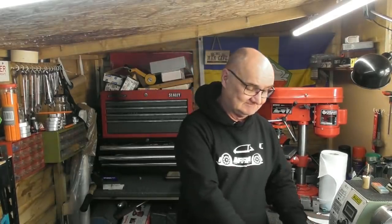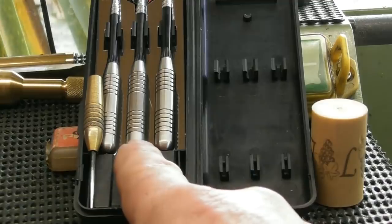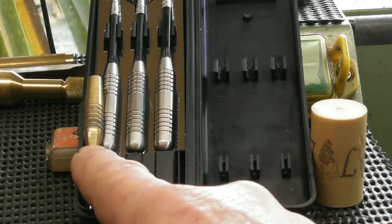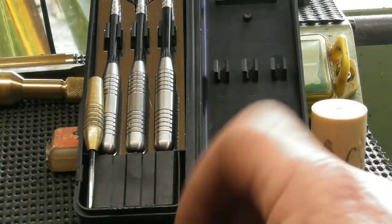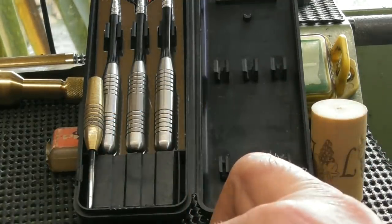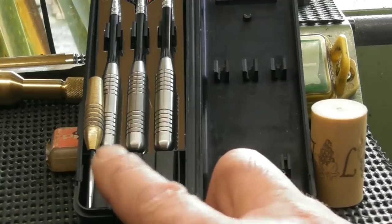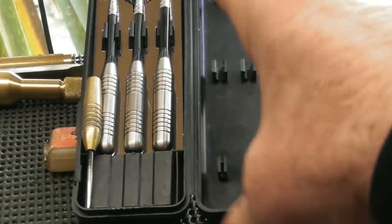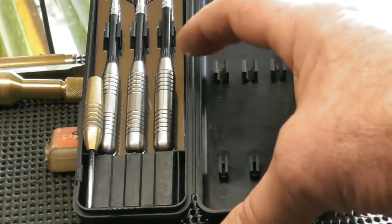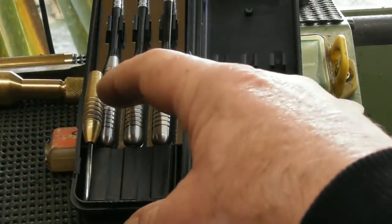There's the sample dart and there are the 40-gram ones I bought. They are 8.5mm diameter, visibly larger than the largest diameter of the sample. They're also way longer, so I need to profile all of the outside and the length to exactly replicate the sample dart. One good thing about using darts rather than raw material is that the points and the point bores are already done for me. To a degree the 2BA thread in the back is already done, although I'm going to have to deepen it to the correct depth to keep the weight of the new darts identical.